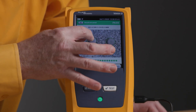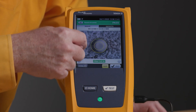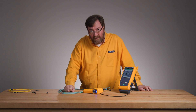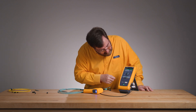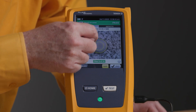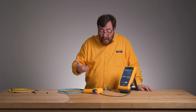If we want to look in more detail, we can zoom in and get a nice high-resolution image of each fiber. Something different about MPO connectors versus single-ferrule connectors: you'll see this composite background surface. Instead of being the zirconia you'd see in a single-fiber connector, MPO connectors have this complex surface in the background — that's absolutely fine, it's normal. We can see all of these are passing, with both the core zone and the cladding in good condition.